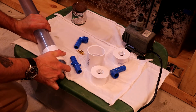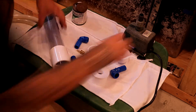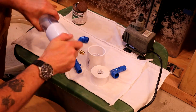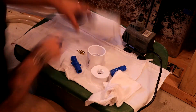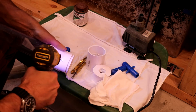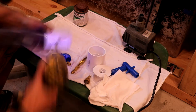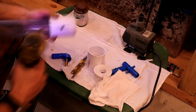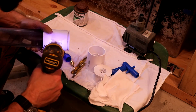A couple of slip fits on the end hold them in place and we're off to the races. We've got those two 90-degree threaded fittings — the blue ones — that are going to be threaded in with some plumber's tape once we have the end cap on. Always be sure to clean up your work as you go. Right now I'm cutting the hole for the brass fitting that takes the CO2 into the reactor. I cut it undersized using a step bit so the hole on the outside is a little bigger than on the inside, giving a really tight fit.